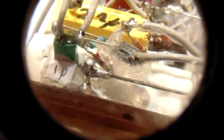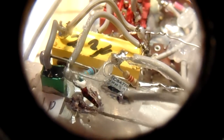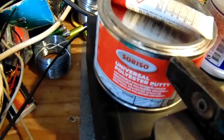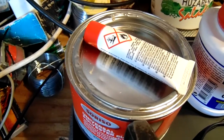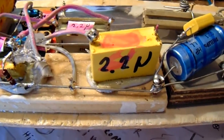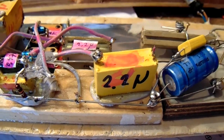Fix that with some silicon kit — you can see that here. Isolate very properly. I've marked all the capacitors for the future and glued the capacitors with this type of glue: universal polyester putty with some hardener. Make some paste with hardener, put your component in it, and within five minutes or so it sits and it's very well mounted.